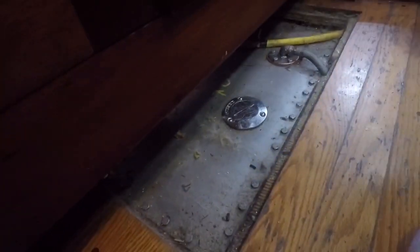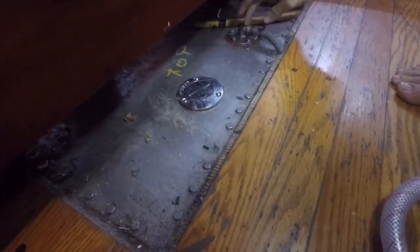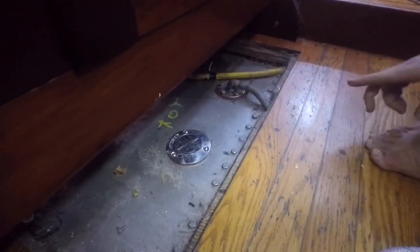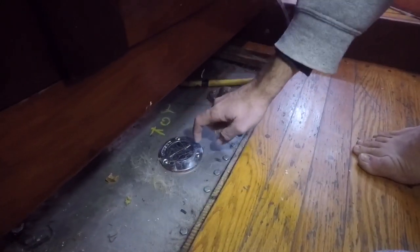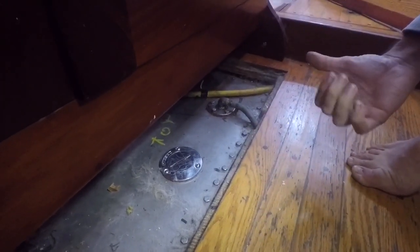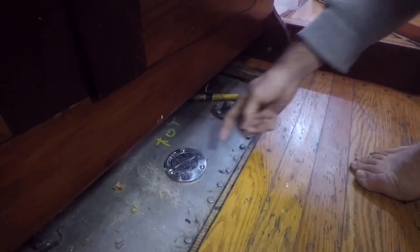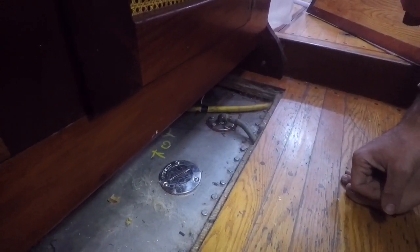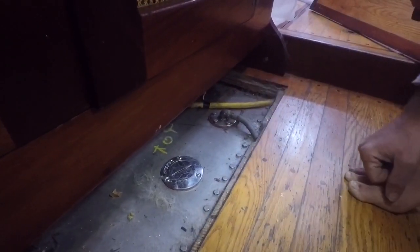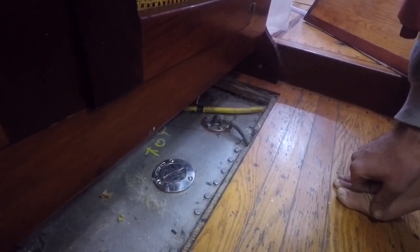In here we have a couple of things — a lot of Morty hair! This is the fuel outflow, and the fuel inlet comes in on the side of the tank. This is our inside access, so we can fill the tank outside on deck, but we usually bring in five-gallon cans and pour it straight in here. The entire top has little bolts holding it on and actually comes off, giving us full access for maintenance or cleaning.